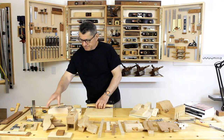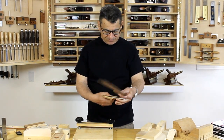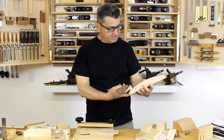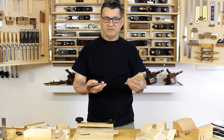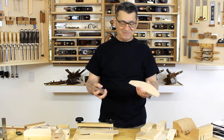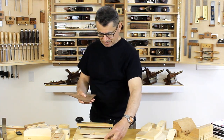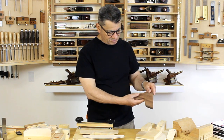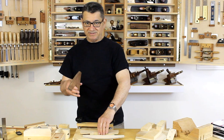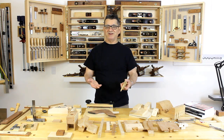So along with woodworking jigs, there are templates. These are just an example of some of the templates I have developed over the years for my own work. These are table leg templates. I create table legs with this contour. When I create tables, I also create the tabletop and the legs and the base. I usually create them in small batches, so I needed to ensure that they're all uniform in dimensions, because I do switch them, depending on the type of wood the client wants. And this is another template for a more geometric type of base for a table. After you've created a piece, my recommendation is to develop templates, because inevitably you'll be recreating that piece at some point in the future.